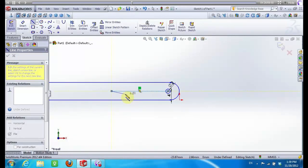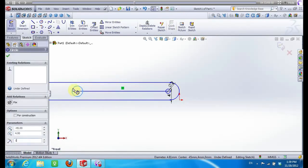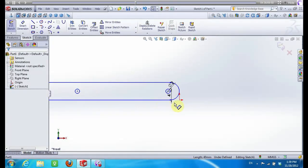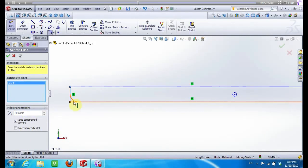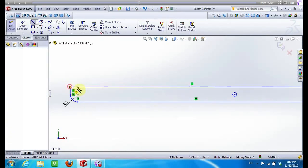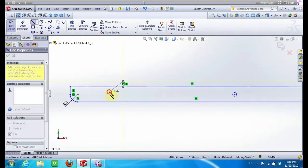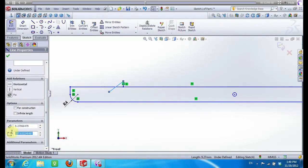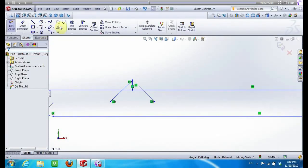Create this line, put 40 millimeters and create circle, put 1 millimeters, delete this line. Now choose options fillet, put 4 millimeters and select these two lines, create this line, put 27.5 millimeters, create this line, put 3 millimeters and create this line, on angle put 225 degrees, select this line and go to options mirror, press OK and delete with options trim unnecessary lines,